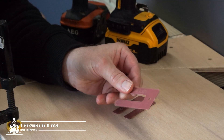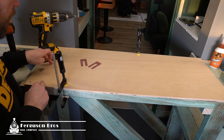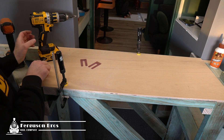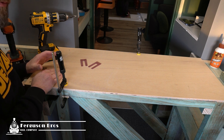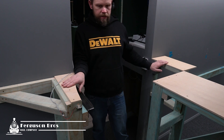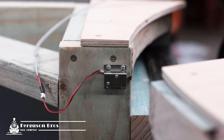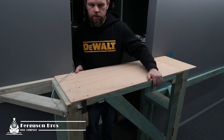I'm using these little packers if I need to, just to pack out anything uneven. The main thing is to make sure these two surfaces marry up nice and level — I've had to pack a little bit on that side. I'm not gluing anything yet; I'm just going to lay down the track temporarily and test it out for a good couple of months to make sure nothing's moving, warping, or buckling. We've got plywood on the gate and on the side so we can make sure it's all flat and test some track. When I close this now you can see the latch is installed and it's adjustable, so we can move it in and out if needed. It's a pretty solid closing mechanism. Passes the earthquake test.